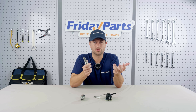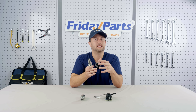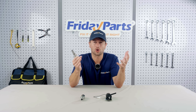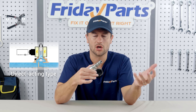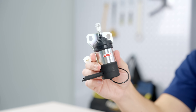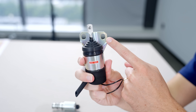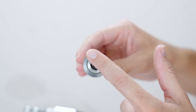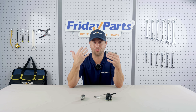Number three is environmental protection. If the working environment is dusty or humid, you should choose a solenoid valve with a protection level of IP65 or above — it must be waterproof and dustproof to ensure long-term use. In addition, pressure and flow rate must also be considered. Direct acting type is suitable for low pressure and low flow conditions, while pilot operating type is suitable for high pressure and high flow conditions. At the same time, the interface type and operating voltage must also match each other. The interface type — such as thread, flange, or quick plug — must correspond to the equipment. The operating voltage must not be selected incorrectly, otherwise the coil will burn out.